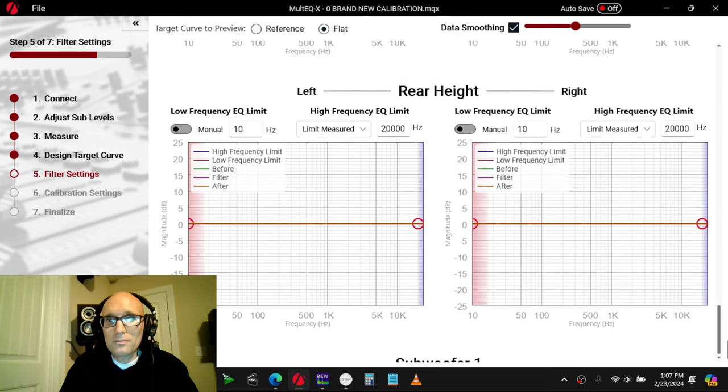And you can align with impulse or phase, but I just got to this point where we went to impulse alignment, and impulse alignment gave me the best results, right? So you might be able to get away with it and do it with phase. I might be able to play around with this file tonight and save this, and I could have got it aligned with phase. But when you get impulse aligns like this from both channels, and you just get this performance, why do I really want to see if another method works? I don't know.